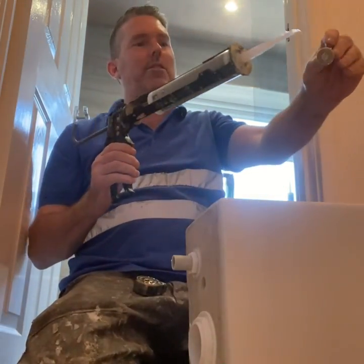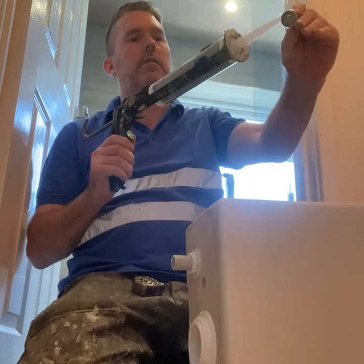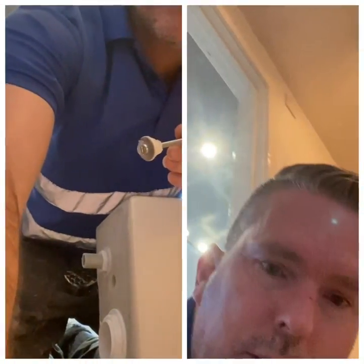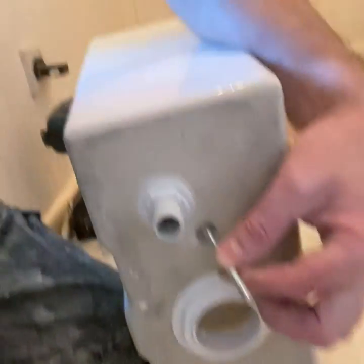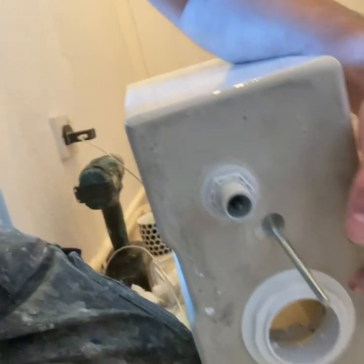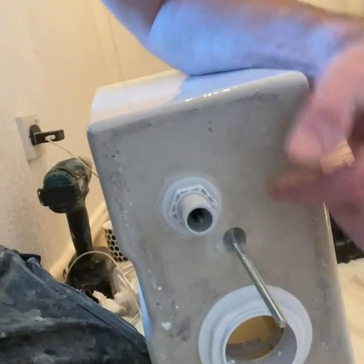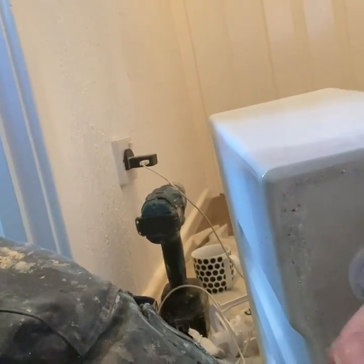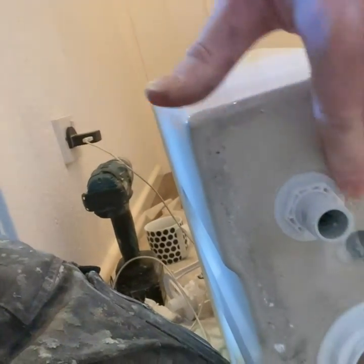Lucky that, I tell you what, it's lucky the screw marks are right. And remember, people, with toilets, make sure when you push that through, silicone in that hole, and then we'll push a washer on and it'll be beautiful. Unscrew the waste, silicone around the hole, screw that back on and it'll be beautiful. Now this is vital to the situation, because you don't want the toilet to leak.